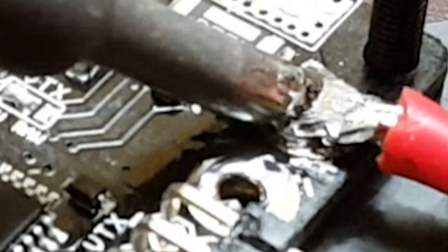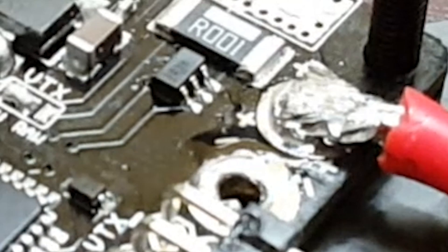That was actually a decent — at least half-decent — solder joint. Did you see the solder flow down off the wire and onto the pad and fill all the gaps and cracks? That's really what you want to be looking for. I don't call that done yet, and I might not have even noticed it while soldering, but that's the minimum I'd look for in a good joint: that complete flowing of solder down into the joint.